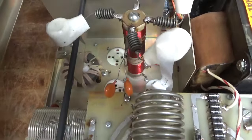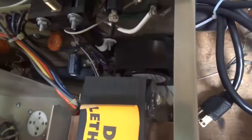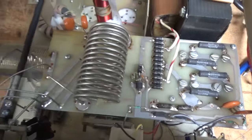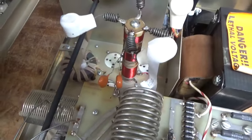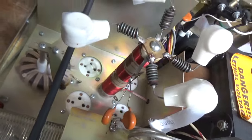We'll tighten up on hardware, clean all of the connections. Input rotary switch, output rotary switch / band switch. TR/bias relay contacts. Needs a new fan. Customer said this one is noisy. I'll also get new resistors, and I'll put a different diode in for the meter protection. I'll compress the socket clips and add a longer screw for the plate choke.